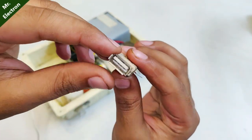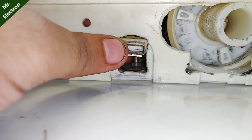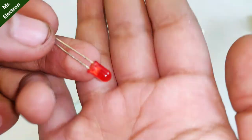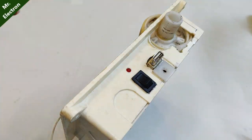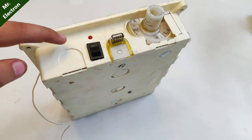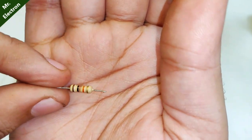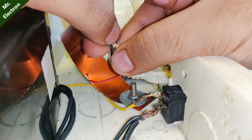This is a USB port which I am going to use to charge this 12V battery, although this port is usually used for 5V as we have seen in mobile charging systems. I have also placed hot glue so that it fixes strongly and rigidly. This is the USB cable and this red LED is going to indicate the start of charging when I connect the USB cable. This is a 1kohm resistor which I am going to connect in series with this LED to limit the current flow. This black wire from the USB port is going to be connected to this resistor.